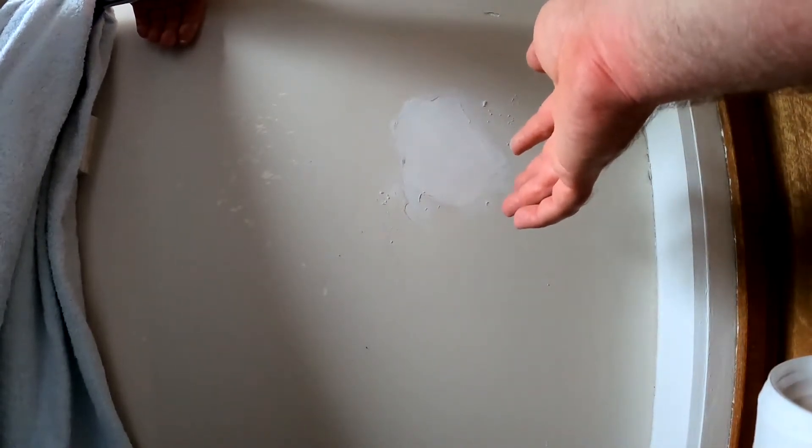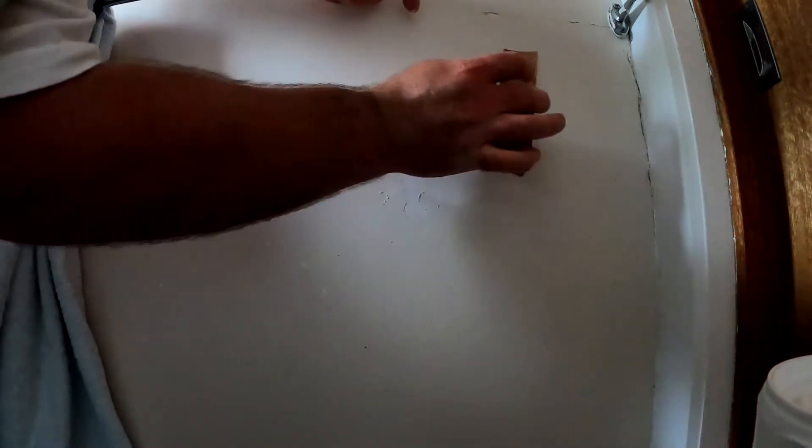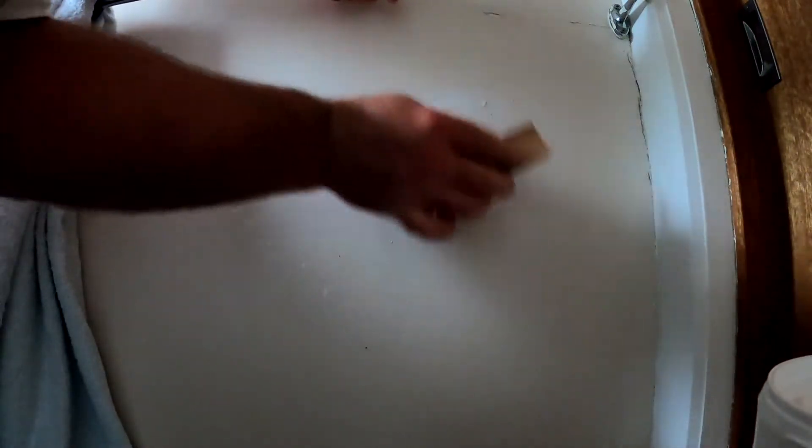When you're doing this with a spatula, the key is to try and get the job as neat and as smooth as possible. That allows less work when you go to sand it and you don't have to make a mess of it. If you're really messy and just blob it on there unevenly, you've got to do a lot of sanding and you'll start getting divots in it. To sand that, you really want a small block and you can go crossways and up and down — that will cut all the outside down so it's all flush and even and smooth.